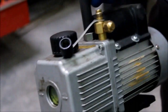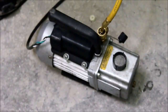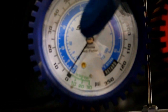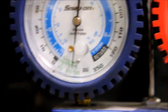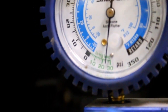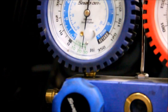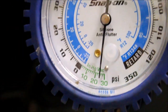This is a vacuum pump — you can pick one up at the parts store on a rental basis as well. The vacuum evacuates all of the air. As the vacuum develops in the system, this dial will approach 30 inches of mercury vacuum. I have an old pump, so about as good as I can get is 25 inches of mercury vacuum — so we're there. I'm going to seal it off, turn off the pump, and then give it 15 minutes or so to see if it can hold the vacuum. It's still holding — the vacuum gauge hasn't moved, which is a pretty good indication we don't have a leak.